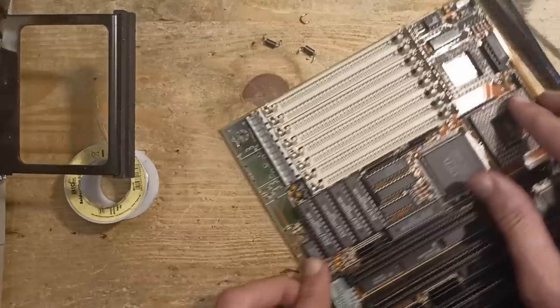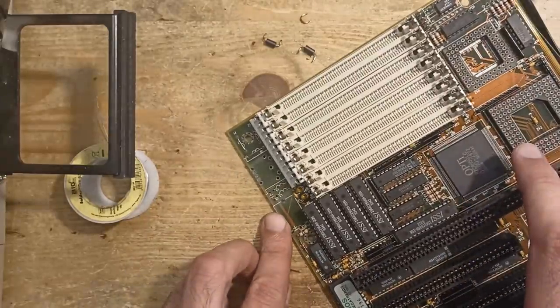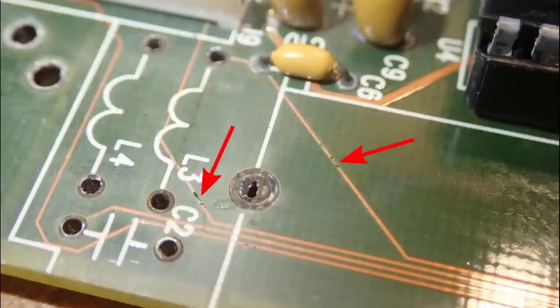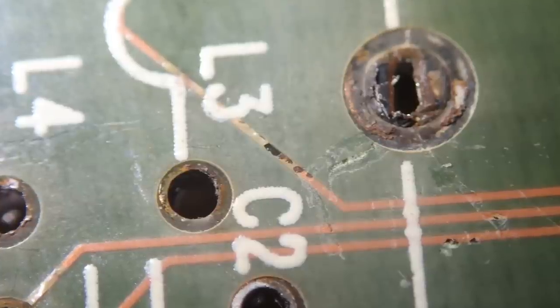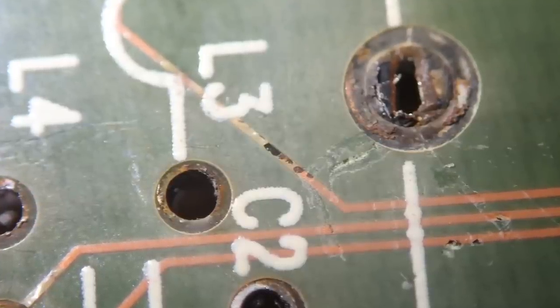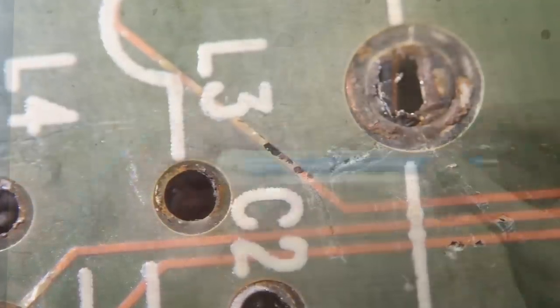So, I removed everything I considered to be in the way, and now the damage is better visible than before. First of all, I'll polish away the solder mask and the rest of the oxidation to get shiny copper traces again, where I can solder some wires if needed.